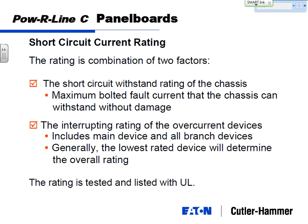When I say separate, inside the circuit breaker there are two contacts that are forced together that open and close. When you're separating two contacts on the inside of a circuit breaker, what's going to happen? An arc follows. When you first separate those, it does not clear instantaneously like it would in a vacuum. Not in a vacuum, you're going to get a little arc that draws while those contacts separate.